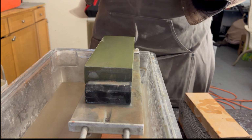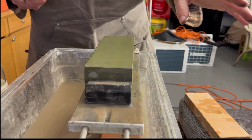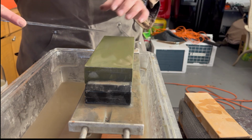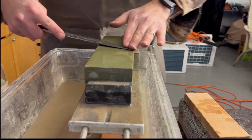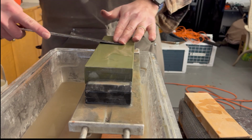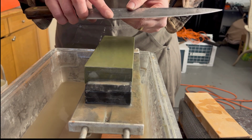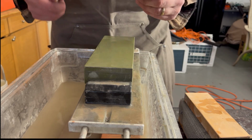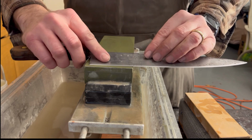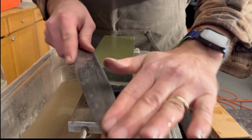So to deburr a knife, we will move to a leather strop and some honing cream in a little bit. But we like to try and get the tip of the knife. On my first one, and I don't know if this is what you're going to see from other people, but because I have the burr on this side, because I had lastly just gone through this, probably my first two strokes, I'll do two in this direction, I'll do one in this direction, and I'll go back and do two here.